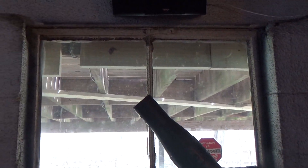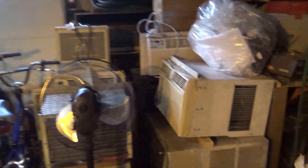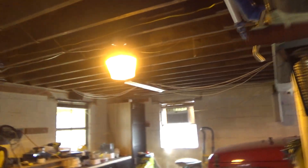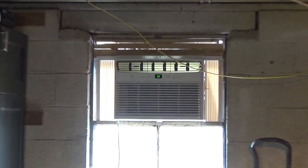It'll be a little tricky because I'll have to shave the top or bottom of that board down so it fits. It'll be protected from the sun. I think I'm also going to swap the machine — either the Hampton Bay 12k or that Maytag. I don't think we need a 12,000 BTU in here because the heat gain is pretty minimal.